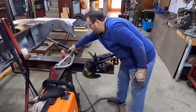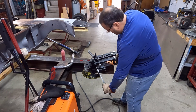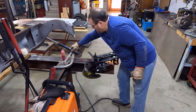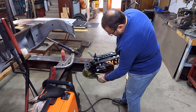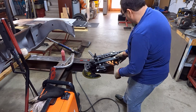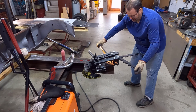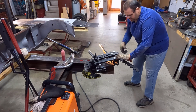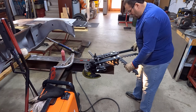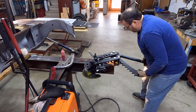So now I'm going to take it, tighten her up where she's holding her, like that. Make sure we're on 0 right here when I pull tight. See, when I pull tight, I'm right on 0. And we are going to 180. This DOM is the 1.5 inch DOM on 95. It is not a problem at all.